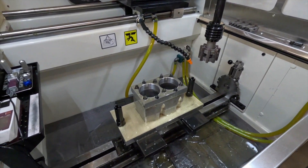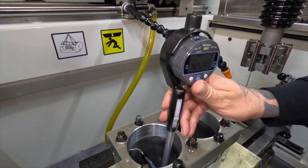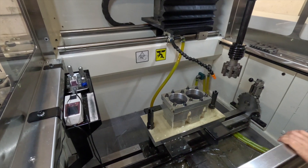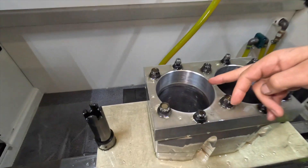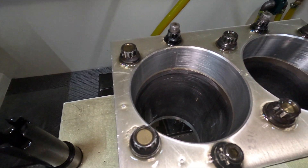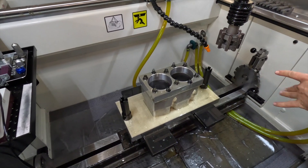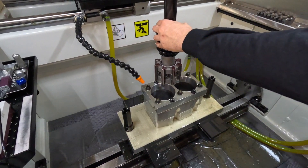So now we're going to take — let me just measure to see where we're at first. We're going to take nine thou and a couple of tenths out of this cylinder. We can see that we've already took two-and-a-half tenths out and it's not round. Now I'm going to load the hone head in and let it take out the material automatically.